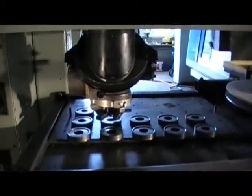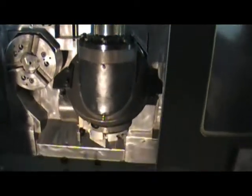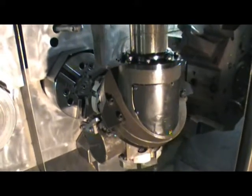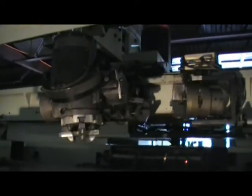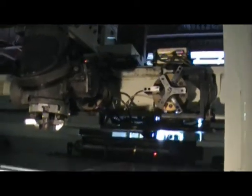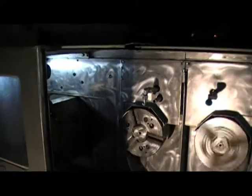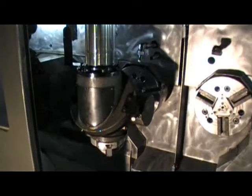The gantry goes in again, picks up the part, takes it up, and unloads the part out of the right spindle. It flips the chucks, loads in the next part, then unloads to the front-rear transfer. It takes the already-transferred part to work on the other side — the transfer chucks are working right now. When the left side is done, it opens up, unloads the part which is already finished and has been transferred from one chuck to the other, loads it in, and drops the part over to the out conveyor.